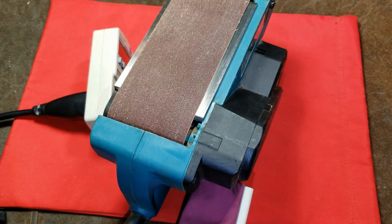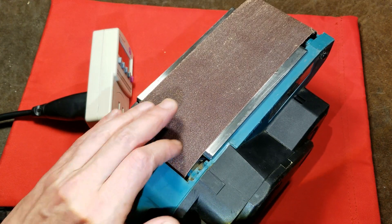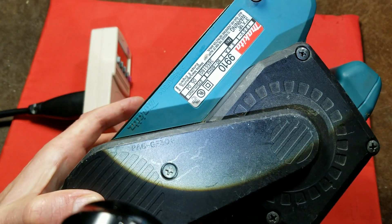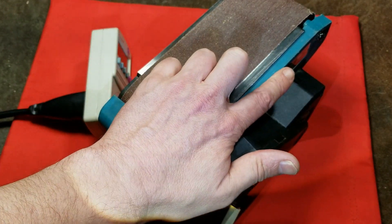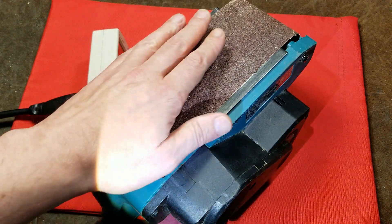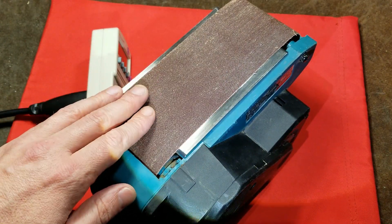Let me get something plugged in here — a power tool. This is one of the reasons I bought this. We have a belt sander here, a Makita, rated 120 volts, 5.6 amps. The amps on a power tool are the full load amps, and there are situations where you really want to remove a lot of material with the belt sander and you want to know how hard to press. You can press on a tool and usually it's about 30 percent load, so if this belt sander is rated at 270 meters per minute it'll slow down to maybe 180 meters per minute when it's actually drawing that 5.6 amps. Old Milwaukee drills on the nameplate would actually have a no-load RPM and a full-load RPM with about 30 to 35 percent difference. If you use one of these you can find out how much pressure to use with a particular grit on a sanding job and actually know whether you're getting into the range or you're grossly overloading the tool.